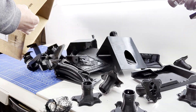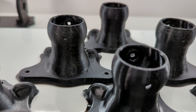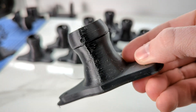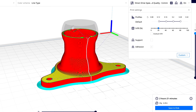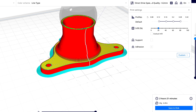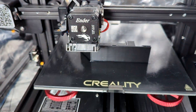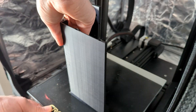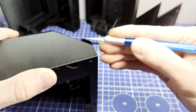Here's my failed part box so far for the build that I'm adding to daily. After many hours tinkering with print settings and Cura slicer I was finally getting good results at higher speeds, but I was having issues with the Z seam as you can see here. I'm using a Creality Ender 3 V2 with a Bowden setup, but it always had issues specifically with heat creep. I upgraded to a direct drive extruder and started to get some good results, and this extruder eliminates heat creep by having an all-metal hot end.